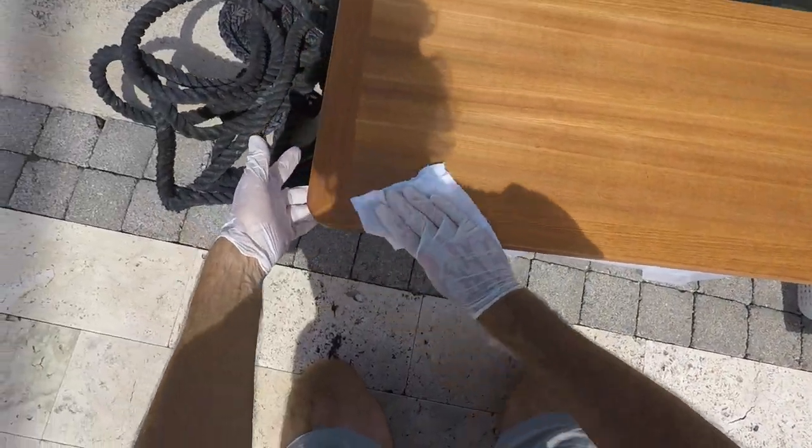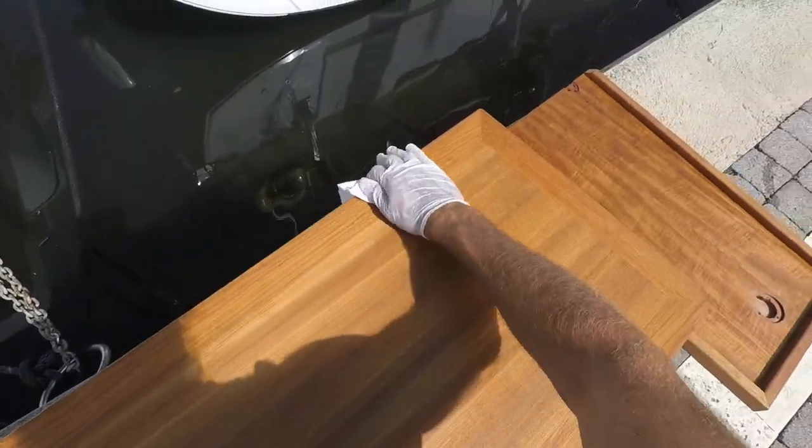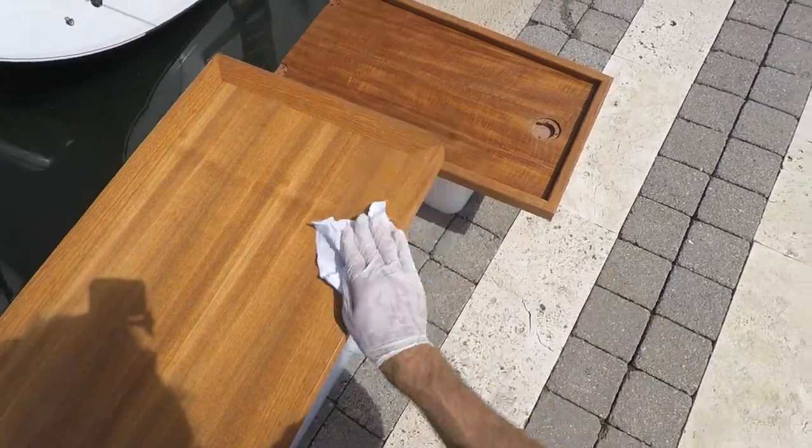You can kind of see how things are going to be covered up. I had some lighter marks here and the oil is soaking in quite well into those, making them more even. I'm not going to varnish down into the pull ring holes or the hinge areas — I just took them off so I can get right around the edge. If you get down in there, there's dirt and you're going to pick that up on your brush and spread it on the surface. This oil I'll give no more than an hour to soak in and dry before we're ready to go with the varnish.